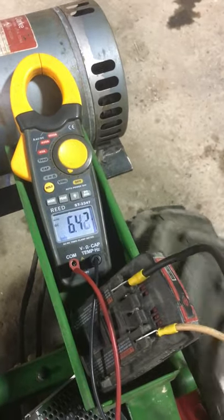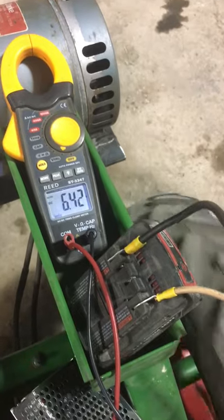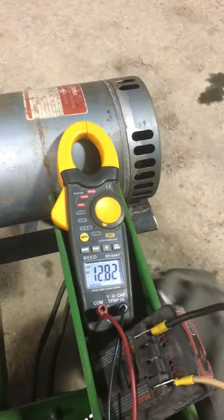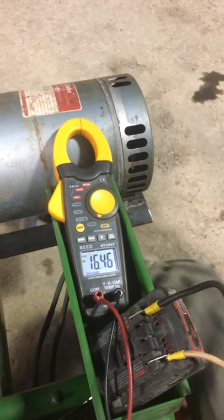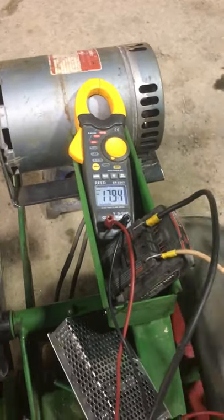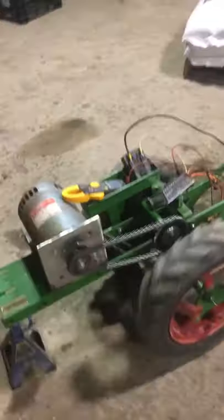This voltmeter is reading not the battery pack voltage, but the perceived voltage at the motor as it comes out of the chopper. So I'm turning up the pot here, going up to 12, 13 — pretty soon we'll get to full pack voltage. The pack is still sitting at 17.9 volts, so this is at full speed with that pack.